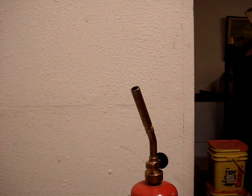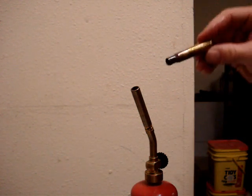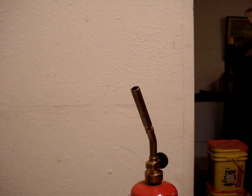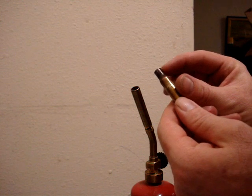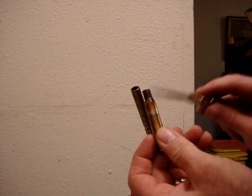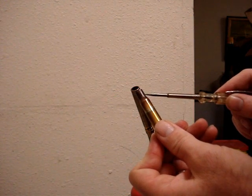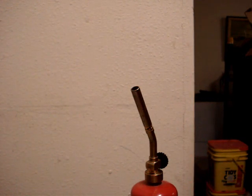Just let them hang dry. There are several ways of doing this. What I like to do is just dry the outside of the case. This is in good condition here. This one almost got a little too warm — once it starts turning blue, this neck here got a little hot. You can see it has like a dark, charry spot on there. It got just a little too warm. Not so much that it will be bad for it, but if that started going all the way down, because this started to probably get right over a thousand degrees, what happens is this will end up getting too soft. Now we're ready to start our cartridge conversion.